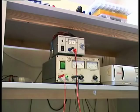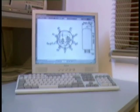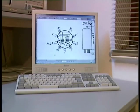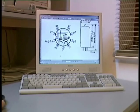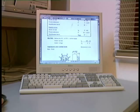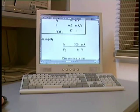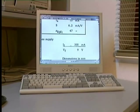To find out which pin is which connector on the vacuum tube, just go to the internet and search for the datasheet of your vacuum tube. Here I found the datasheet — you can see the connections and other useful information, including the heating voltage it requires. Never put a too-high heating voltage into your vacuum tube because then it will be damaged.